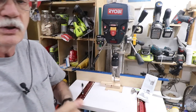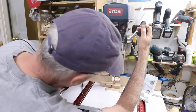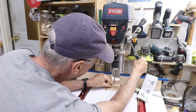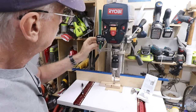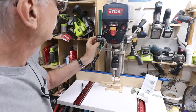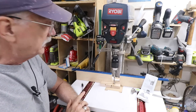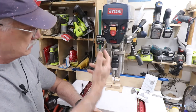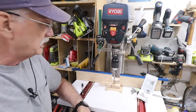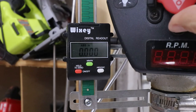Let's chuck this up in the drill press and make sure I've got enough clearance. My first step is I want the flat of the bit to be the bottom of the hole, so I want to set this so the center spike and the wings are just dug into the wood but the flat part of the drill bit is on the surface. I'll lock it up, turn it on — it's at 480 thousandths minus. I'll set that to zero. So that's zeroed at that point. Now I want to drill the hole. I'm going to bring the camera up right to the readout so you can watch me drill to 250 thousandths, or a quarter of an inch, and see how close I get.